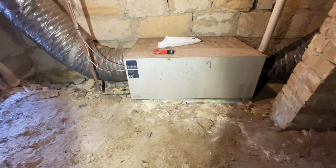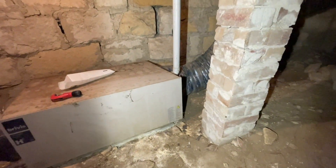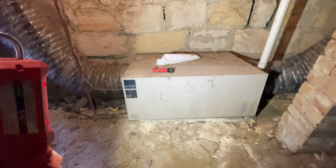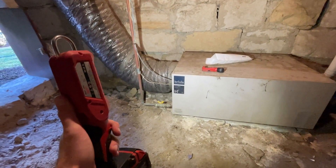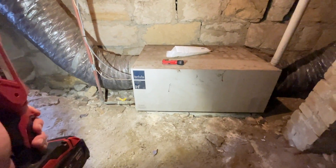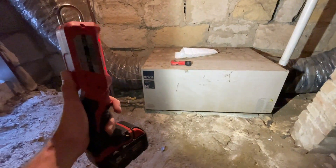This is the Brivis gas furnace — basically just sitting on the ground. It's got like a 12-inch duct off the front and back. I'm just not a big fan of these because they have no airflow. They run 8-inch ducts to all the rooms and they produce really hot air, but they never have good airflow in my opinion. Gas is no longer cheap in Australia and people are moving away from it, so we're taking this out and replacing it with a Daikin unit, and we're going to put the indoor unit in a new location.